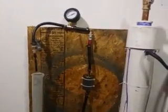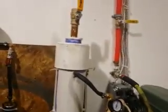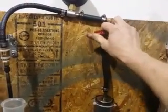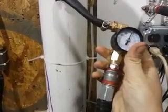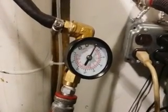To demonstrate how this sucker works — right now the system is depressurized. I go ahead and make sure the valve positions are all correct: shut the isolation for the pressure vessel, shut the valve for the injector so it doesn't spray yet. I already have the air valve preset slightly cracked open so it doesn't go too crazy when I start opening it. Now that we're set, let's start cracking this open and get the pressure up to where I need it.